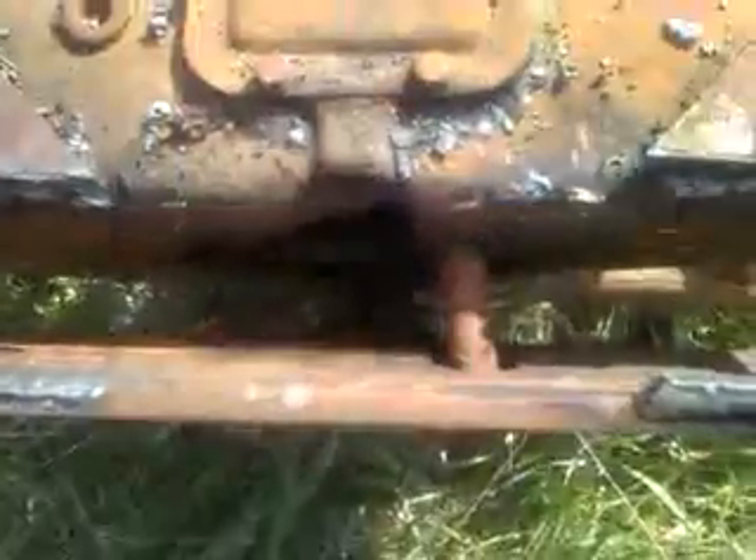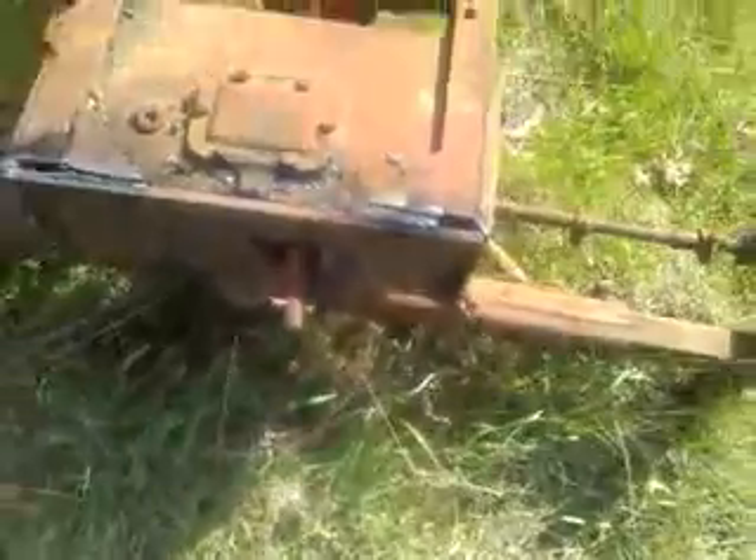I'm not sure if this hole can be patched or filled in. If I can make a new front piece that goes out wider and somehow get two new holes drilled and tapped up here, then you'd have four mounting bolts — that's the later style four-bolt wide front end. Either that or I'll have to look for a different bolster. But that's going to be one of my projects — I'm sick of having this here.